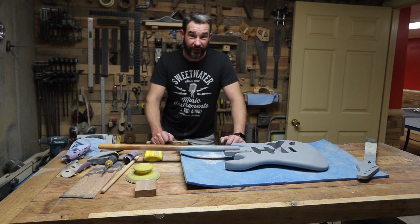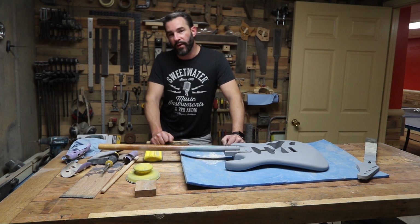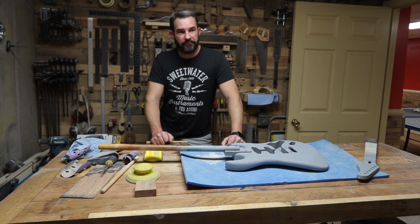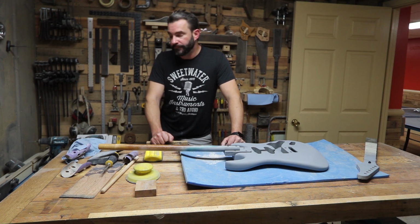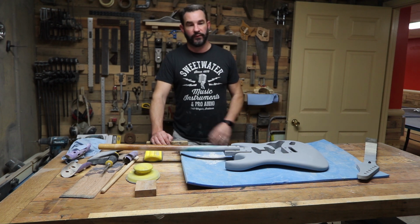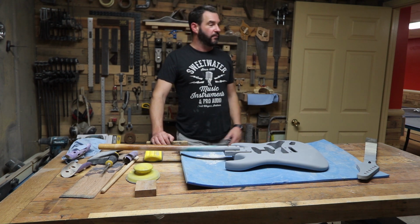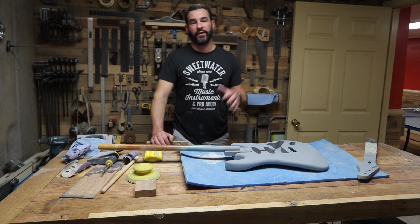The wood around it would sand faster than the super glue, so I abandoned that and went back to the drywall compound. That was purely out of impatience and wanting to shoot more primer over it that night, which is why I went with the super glue route. Bad call. Went back to the drywall compound, and it worked better and sanded at the same rate as the plywood, so it didn't cause any issues. Shot it with more primer, sanded back, shot it with more primer, sanded back, just trying to fill in all the grain.